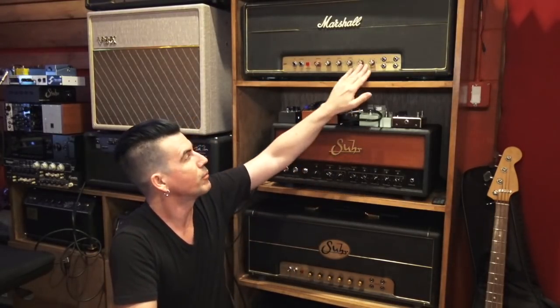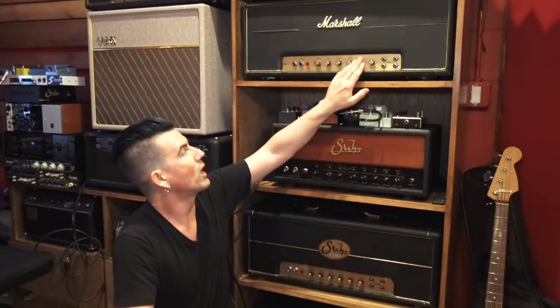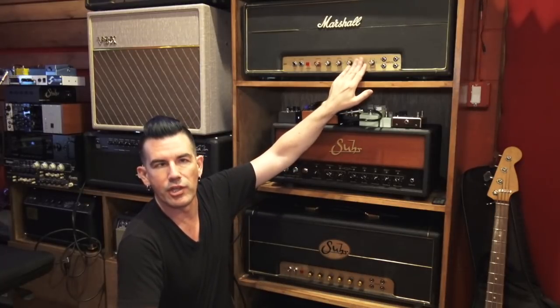Number one, it's got brand new preamp tubes in it, Chinese preamp tubes and JJ EL34s, whereas the SL68 has old Tesla EL34s, and I think Amperex and Mullards in the preamp. So that could be a significant difference right there. In addition to that, the aggressive bright cap on volume 1 on the 50 watt amp is really limiting, I think, the range of tones that I can get out of it at anywhere below maybe 6 on the channel 1 volume control.